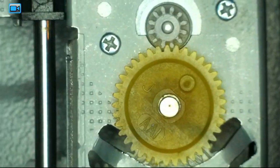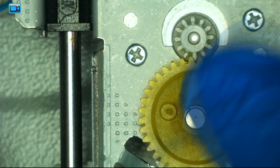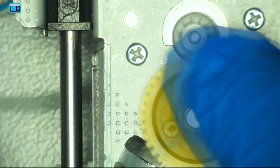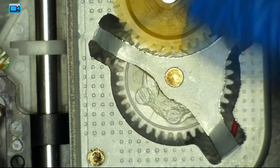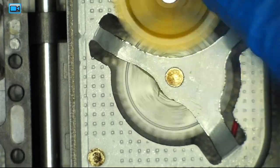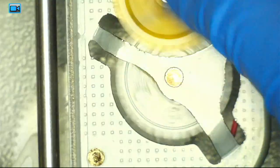So there's the transport — the gears for it. You can see all the teeth on the gears look good, nothing's missing, it turns freely. The grease in it actually still looks good. There are some more gears at the bottom there, but as I'm turning this, the thing is turning perfectly smooth — no binding whatsoever. So the transport is fine.